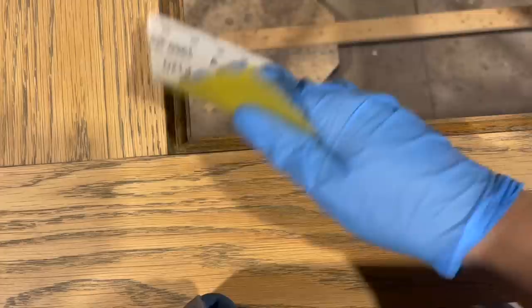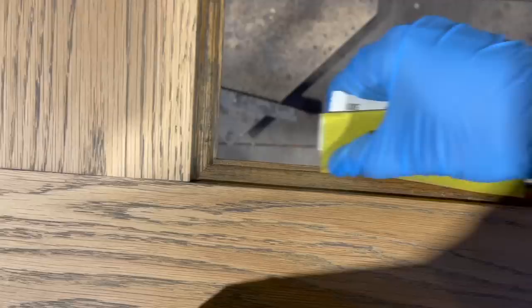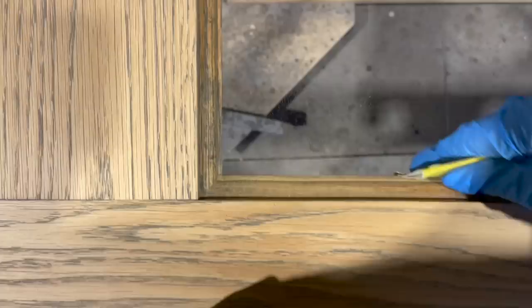It fits in your hand nice. You can maneuver it. I can get it into this corner. I can switch it down to go over this round over and then get back into this groove and then come up the other side of that round over and finish off with the inside there and then hit the corners. That's what I'll be doing. So that times however much to get all of this sanded, it won't take that long, but that's the only way to do it. And it's the proper way to do it. So don't skip this step.